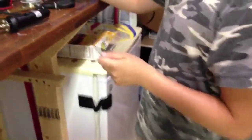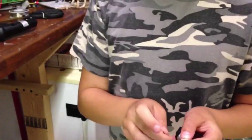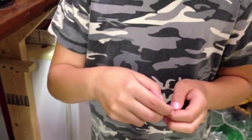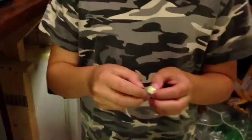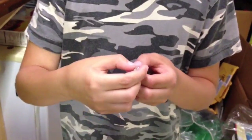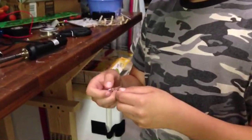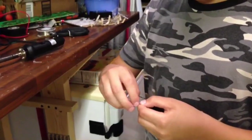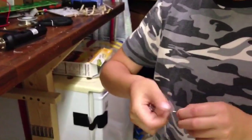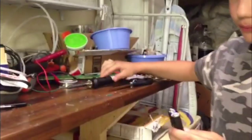Here's the LED we'll be using — it's a bigger one than a normal one. You want to connect it to the right terminals, so you can just test to check if they're actually working. When you find the right one, keep that in mind. I like to wrap the wire around the LED leg, and then solder it up. I wrapped it around, then I soldered it on.